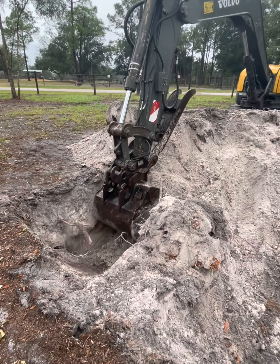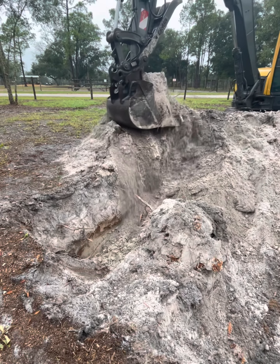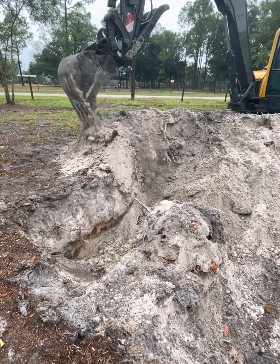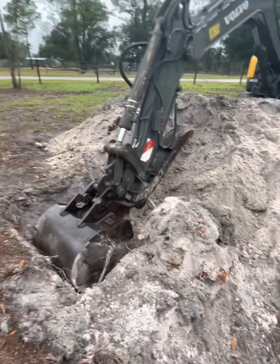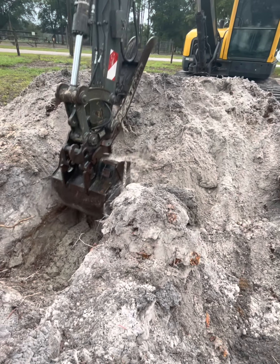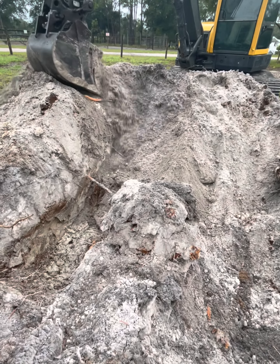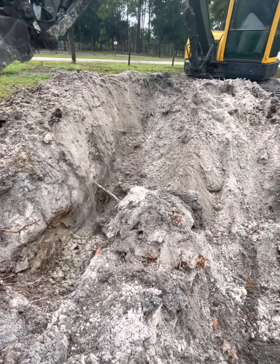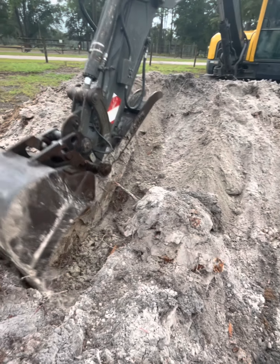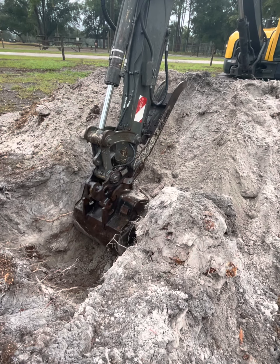I think here is where he starts going deep. What we do when we get hung up on a pine stump like this with a big tap root — the best answer I have for you, once you've dug around it and cut the side roots and you're sure they're cut and it still won't come out, is pick the side that digs the easiest and go straight on down. Just go right where it's good easy digging, and go on down past the bottom of the root. There's a little bit of the tap root right there that we're getting into now.